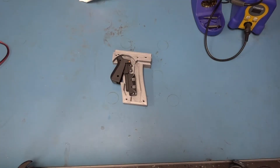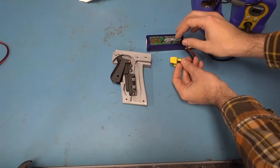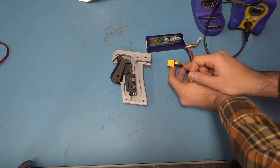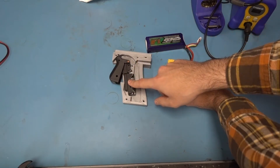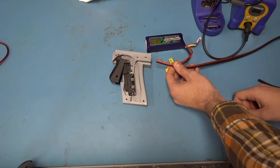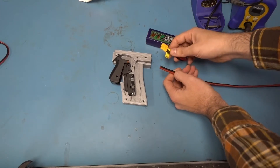So let's talk about the circuit. We're going to want the battery somewhere just on the outside, zip tied to the PVC or something. Then the electrons are going to need to go from this connector into another connector that we'll have to solder up, in through the back side of this grip, in through the trigger and back out. Then with this wire here, it's going to go all the way to the back end of the PVC to light the bottle rocket, and because we have to make it a circuit, it'll come all the way back and connect to the battery again.